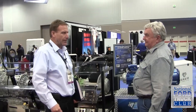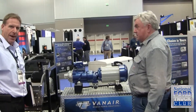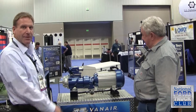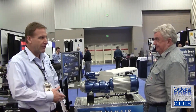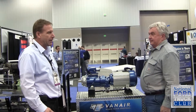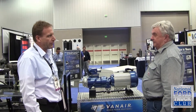Opening up the bed space on the truck and giving your operators some serious air power — right, do jackhammer work or rock drills, things like that. We've got another option too, where you put a generator right on the back of the compressor, and now you've got the ability to do 185 CFM of air along with 10,000 watts of electricity, all under the truck, hidden away, leaving the bed space wide open, and only consuming about 500 pounds of payload. So now you've got extreme payload increases, a hitch that's wide open, and just lots of ability to do more with your vehicle.